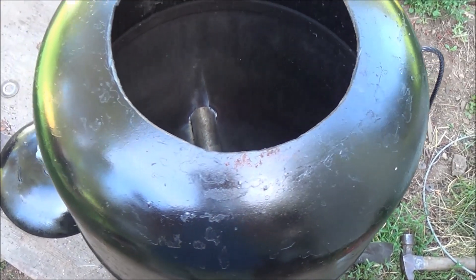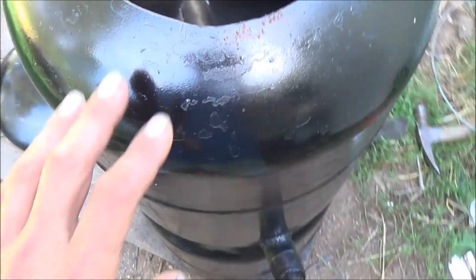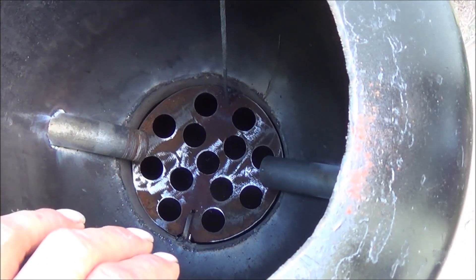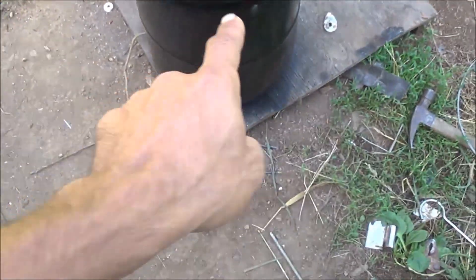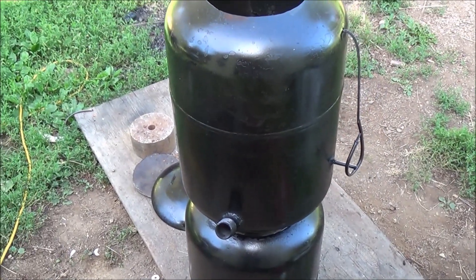You can see they both protrude just slightly out over the edge of the reduction zone, so they're not right up to the edge — they extend out towards the middle. That allows us a more direct burn right down the center of the column there. That is all you're going to need to do to be able to make this gasifier, basically. All the working pieces are done. The only thing I have left to do is find some way to hold our lid down, some spring latch system or something. But now we can dump the ash, we've got air flow into there. I'll put some plugs in these so that you can regulate it well. All we have to do at the end is put a hole-saw hole in our lower container for a gas-out pipe and some legs on it, and this gasifier is ready to go.